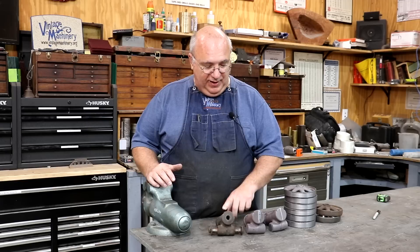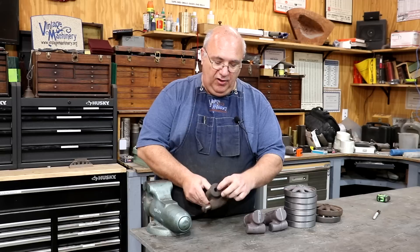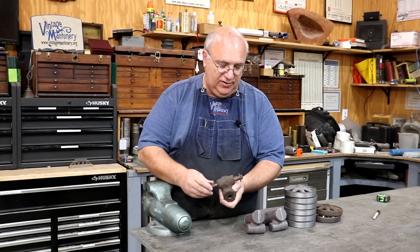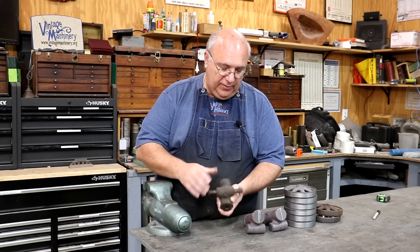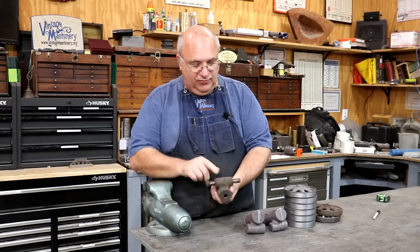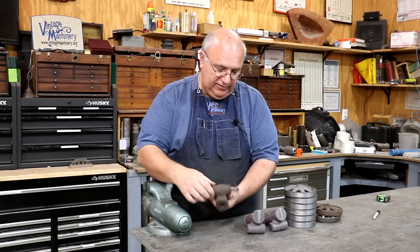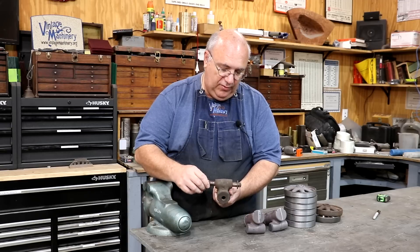For these castings, basically we've got to do a hole all the way through this front barrel, and there's actually two holes. There's a small hole that goes all the way through, and there's a larger hole that goes almost all the way to the bottom. And then we've also got another hole that is cross-drilled across where the axle goes in, and this axle is made to kind of wobble. So as it turns, it kind of finds where it needs to be to turn properly as it's going around a curve.